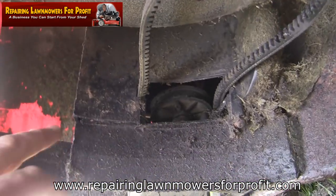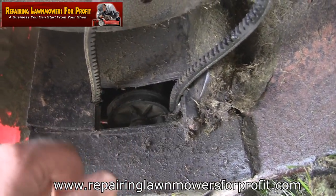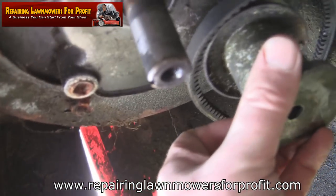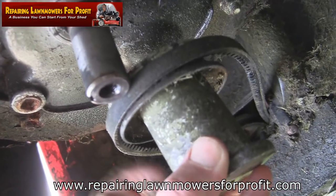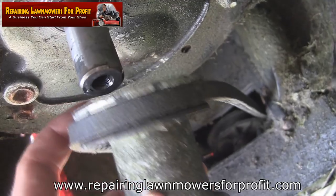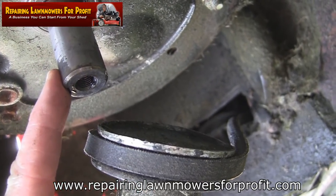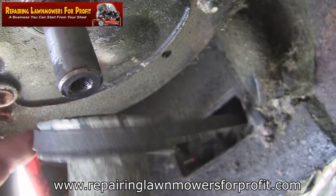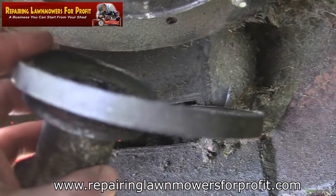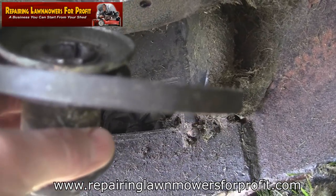Before you start this, just make sure this belt actually goes all the way around this back gear here. What I normally do is put the belt on - it's very difficult to film - I'm going to put the belt on, slide it back over, put the keyway in and line everything up, and just push this back on. It needs to stretch the belt a little bit. Basically put the keyway part to the top so the keyway doesn't just keep falling off. I always just wind it around a bit, put the keyway in, and slide this back on.